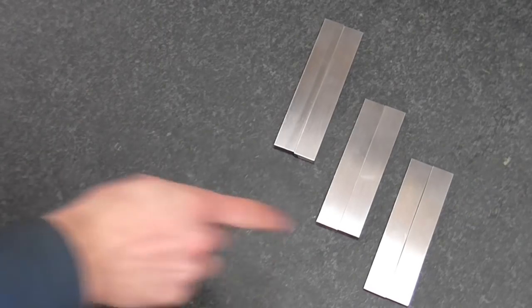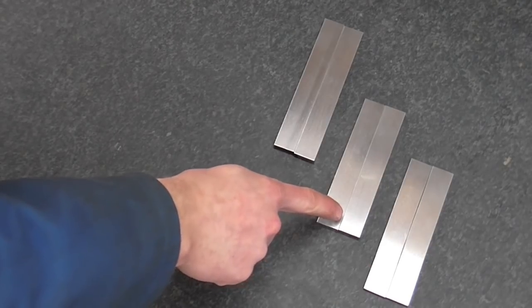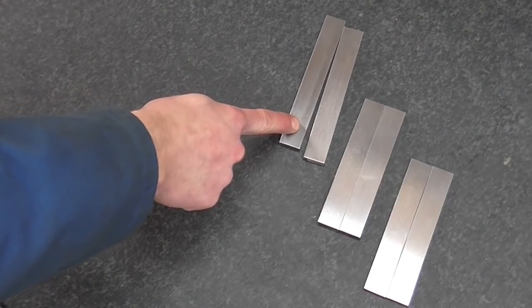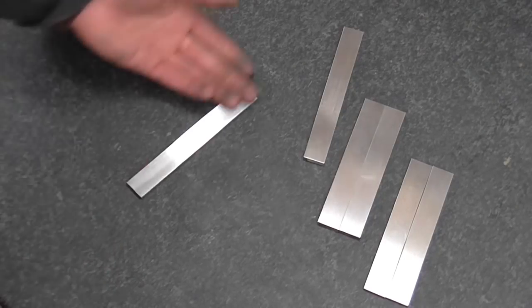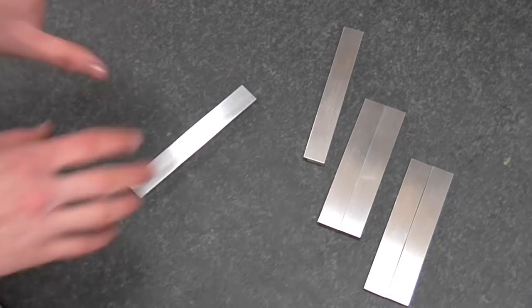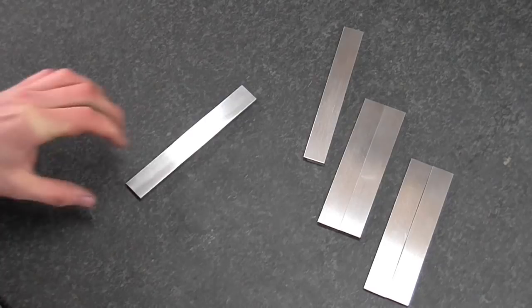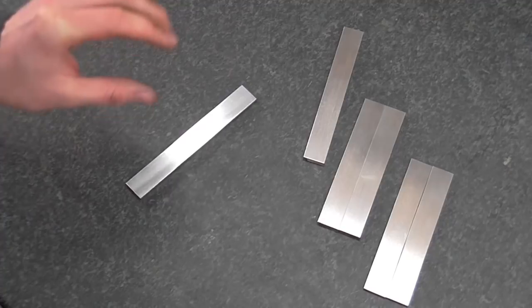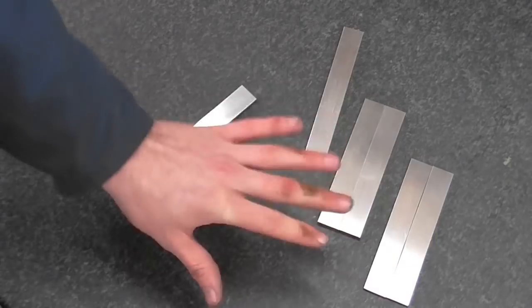I've been to the band saw and cut two 1/8th pieces at the shorter length, two 3/16th pieces at the shorter length, and two 3/16th pieces at the longer length. I've then taken a file, broken all the edges, and used some emery cloth to give it a quick once over. This leaves the material in a condition where I can carry out a quick check before I begin. What I really want to know is how flat it is and whether there are any surface defects. You can see here I've got a scratch, and I'm going to consider these errors when I decide how to stack the components up.